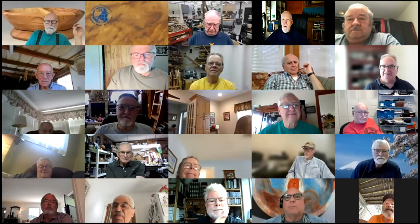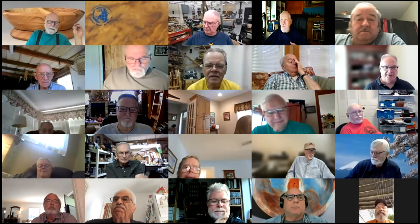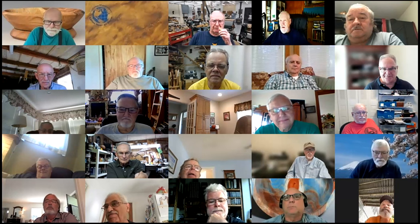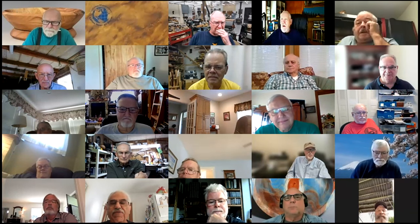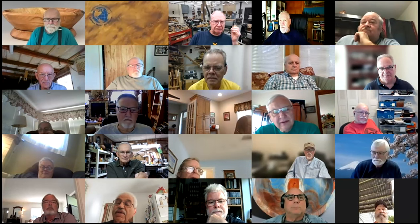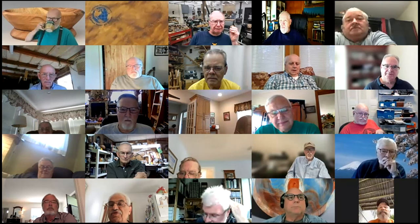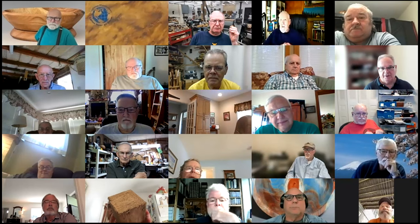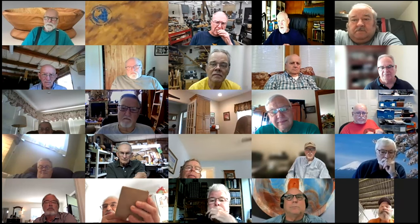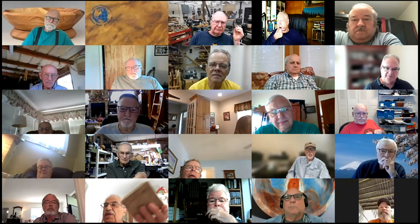Hey, John, what have you got? Okay, I'm unmuted now. Good. All right, this is a little off topic. It's about wood. And since you were looking for some hands, this past week I relocated my canoe rack. It's been in place for over 25 years. We've used 4x4 posts that are pressure treated. And this piece of wood, this is the bottom that's been in the ground for over 25 years. And the reason it's not rotted is because I put it in sand and not in concrete.